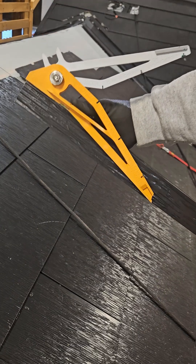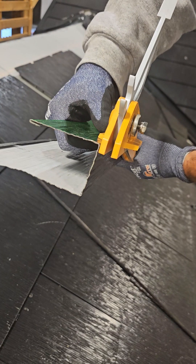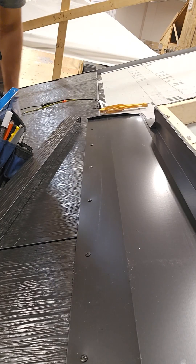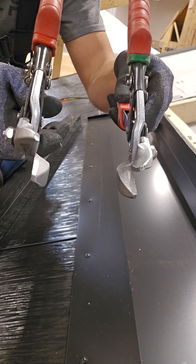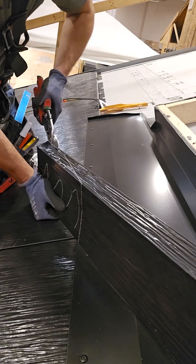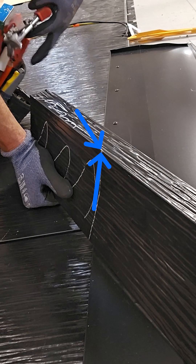For the tapered cut at the bottom, position the robin jig flush to the front end, then trace out the underside of the robin jig. Ensure the robin jig is on the top edge and not on the deck portion. Cut away the metal within these lines. For an end-to-end clean cut, it may help to use both left and right offset snips. Start with the pair of snips that has the top blade closest to the edge of the channel flashing. Once in the middle, switch to the other snips to cut into this corner of the metal.